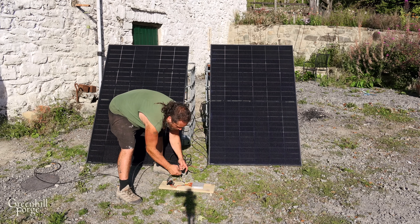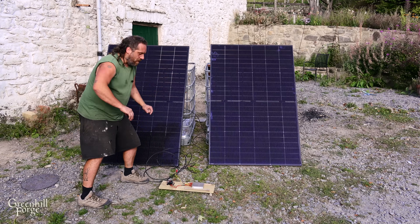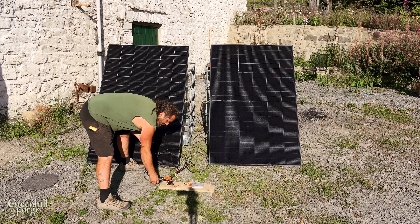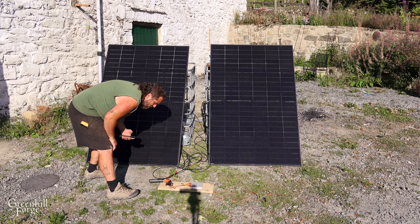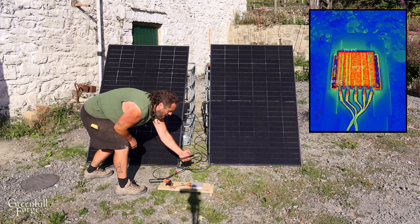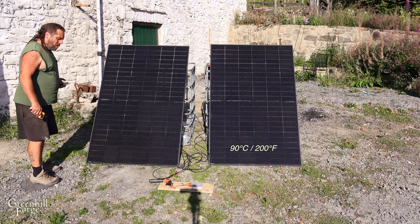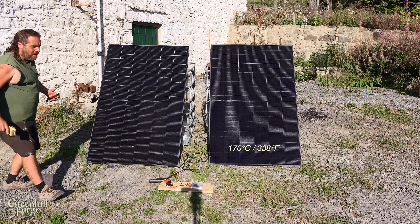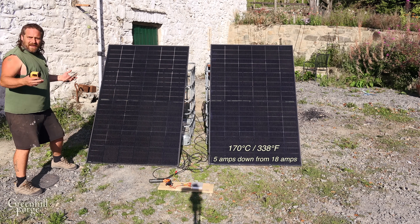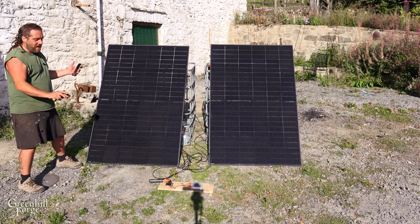Now I'll connect the negative lead with a wire nut for this test. Everything should be ready to go — I just need to close the breaker, but I'm going to set the thermal cam up first and stick the amp meter onto the positive lead. Here we go. Right off the bat, it is drawing 14 amps, and that is getting hot. It's up to 90 degrees Celsius. We're at 18 amps — that is about 170 degrees Celsius. And it's down to drawing five amps. So as the temperature is increasing, getting close to its max temperature of 200°C, it's drawing less current. So far, the system's working perfectly exactly as it's supposed to.